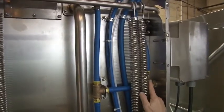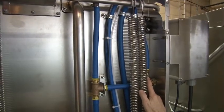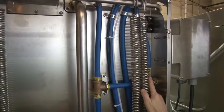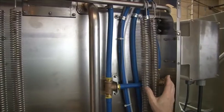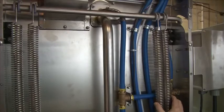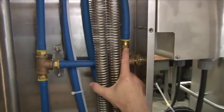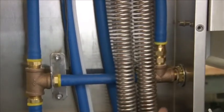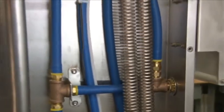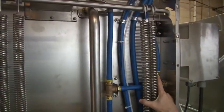When making the third connection for the VHR, slide the springs over to the left — that makes easier access to this connection point. When sliding the springs over, raise the doors to take tension off the springs, making it easier to slide them and access the connection point. This is for your final rinse manifold, which comes out of your heat recovery system. Be sure to slide the springs back into place, completely vertical.